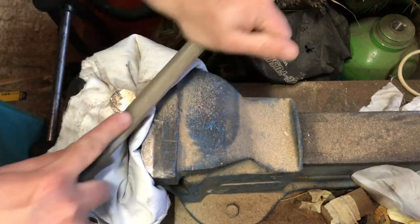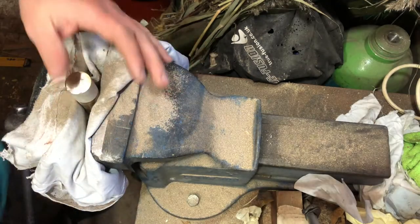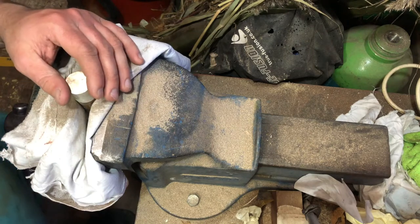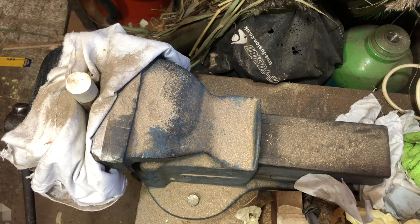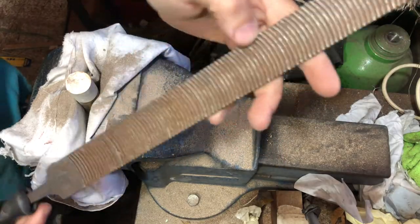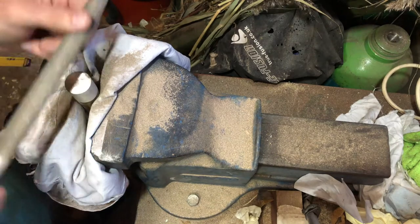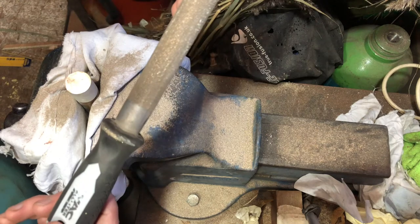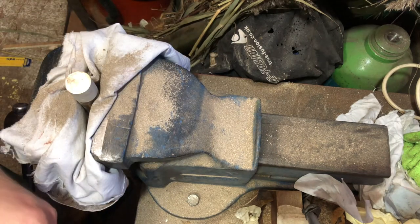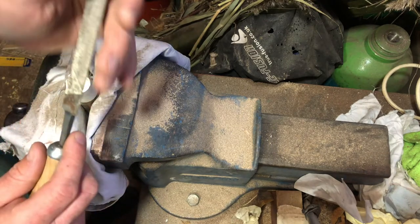Just trying to bring it down to that line. I'll bring you back in a bit. Okay, that didn't take as long as I thought. What I did was just rip out the bulk of it with a file - this absolute beauty donated by my dad, I don't know if he knows he donated it. It's made in England, which probably means it'll break in a bit. Then I came in with a crosscut file - these are just cheap McAllister things, probably from B&Q - and then switched to a little hand file to take the larger file marks out.